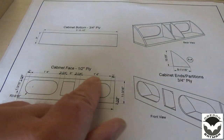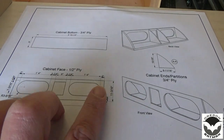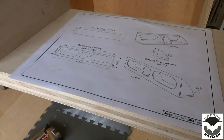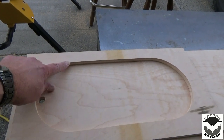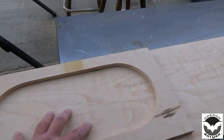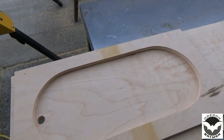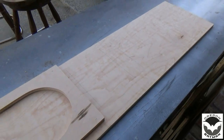Now we're getting ready to cut the ovals. I made a little template that I fastened to the back face - I'll router that out, take the template off, put it on the other side, router that one, and then worry about the center hole. I took a piece of half-inch plywood, cut my radius - three and nine-sixteenths by seven and three-sixteenths wide - and cut that out. Set it in place lined up with my lines, put a hole for my router bit, and now we'll just go ahead and router this part out. Then we'll take the template off, put it on the other side, do the same thing, then cut the center piece out and we're ready to install.